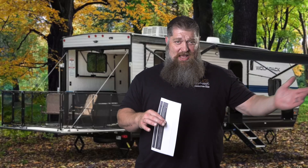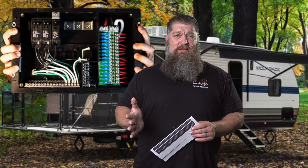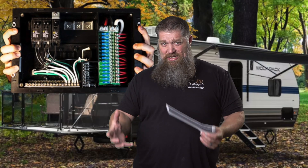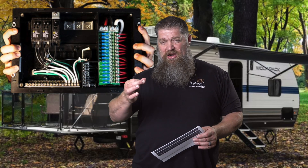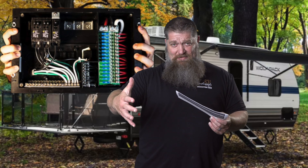If you were to take your breaker panel box and convert it over to a 50-amp style breaker panel box, they need two hot legs, and you're going to connect it to a 50-amp service instead of a 30-amp service, so you're going to have to switch your power cord out. You'll also need to switch out your breaker panel box — all those breakers in there will need to come out. You'll need to mark all the wires coming in so that when you put in the new breaker panel box, you can correctly identify everything.